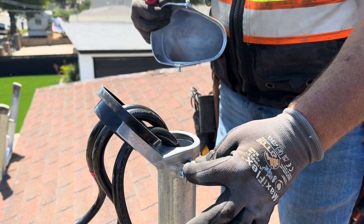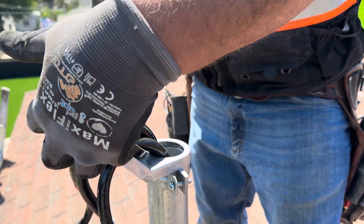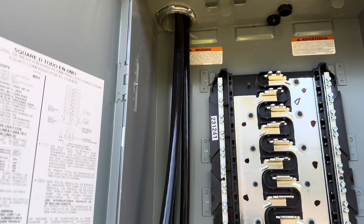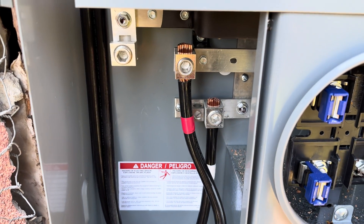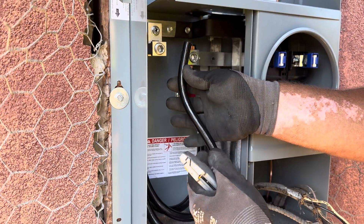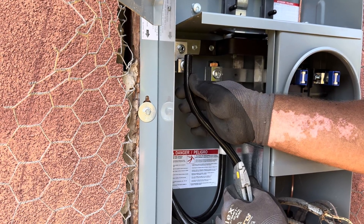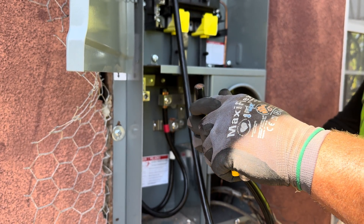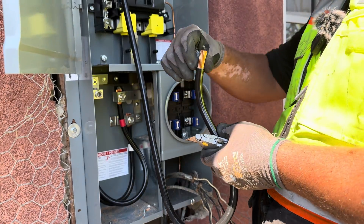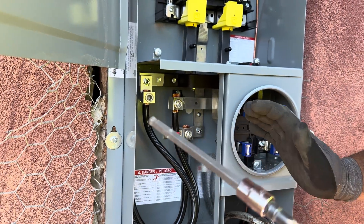When connecting the weather head, make sure the two screws are evenly tightened — you don't want one side slammed and the other wide open. Get your wires up there, bend them nice and clean, knock out your holes, put the cap on, and tighten them down. Once the new riser is in, pull your conductors down. To land the black conductor, bend it without exceeding the bending radius, mark it with your thumb, and carefully strip it with a blade — you don't want to score the copper.